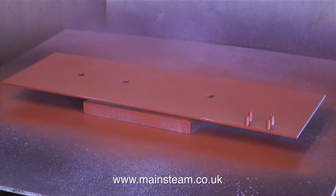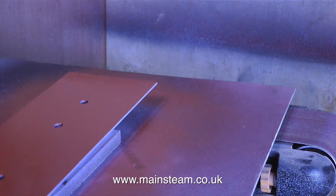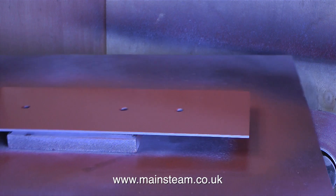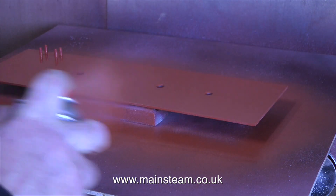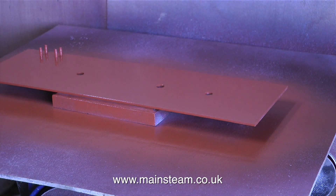I used the grey etch primer first, gave it a light rub down, and now I'm using red oxide primer. I always spray paint in the outer part of the workshop, and I usually put a piece of board on top of my belt sander, which is very convenient for painting on. You will notice that I rest the part that's been painted on a wooden block on the board. This makes it very simple to lift the part when it's been painted and put it somewhere else.